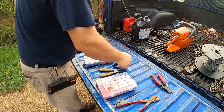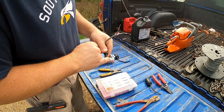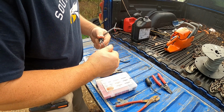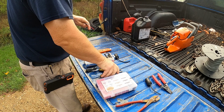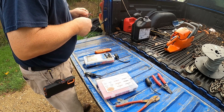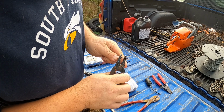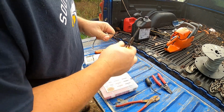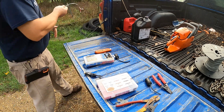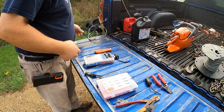Now, to keep us from getting confused, this company has graciously given us a black wire with a white stripe. That'll be our hot or our red wire. Lovely. And get it to strip. You want about a 1/2 inch. And this keeps mine from falling on the floor, so a little knot there to keep that from happening.